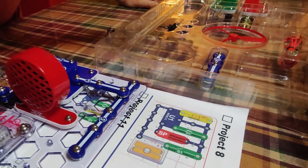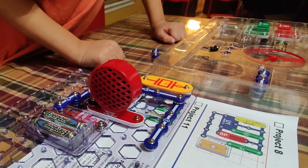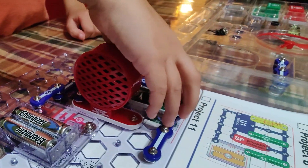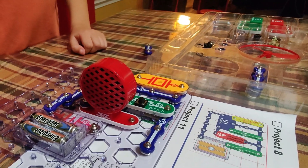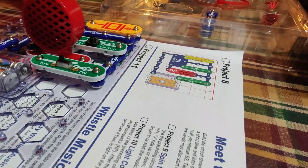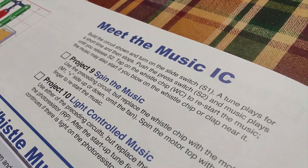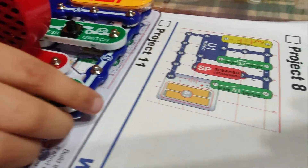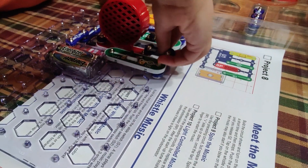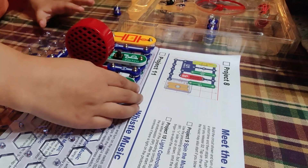Looks like it is calling for a whistle chip. Then we're going to look for S2 switch to go in there — that's like a momentary switch. And then S1, that's going to complete our circuit. Nothing — the tune plays for a short time and then stops. What are we missing? Oh, we forgot to complete the circuit. See, there's another number two that goes there. That's why it's really important to follow the schematic.